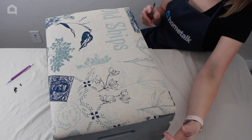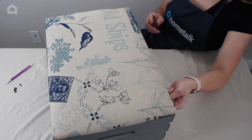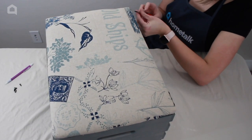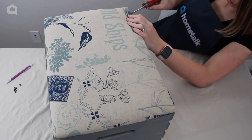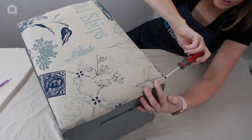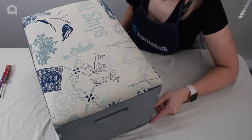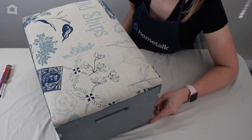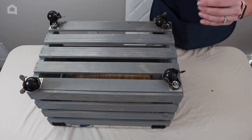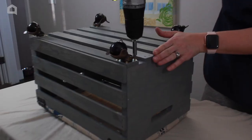Because this wood is so pliable, you don't need to pre-drill — and I wouldn't recommend it since these pieces of wood aren't super thick. The screws that came with the decorative hinges aren't very long, so I feel confident they'll hold just fine. Go in with a screwdriver and manually secure them. Now the lid opens and closes. The last step is attaching wheels to the base of the storage ottoman so it will roll around. Apply the vintage-style wheels to the base using tiny screws.